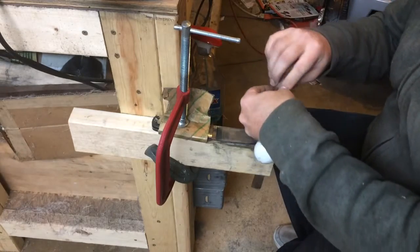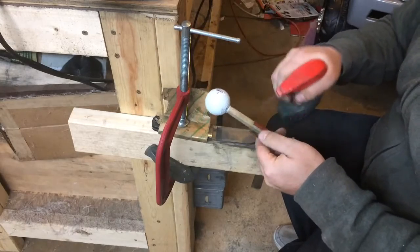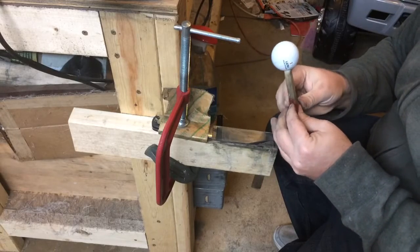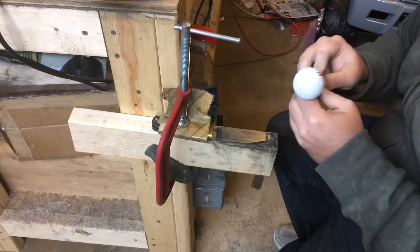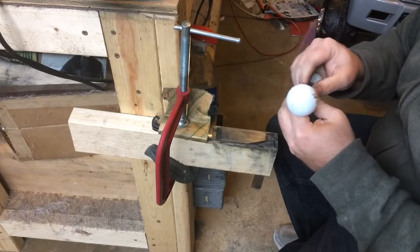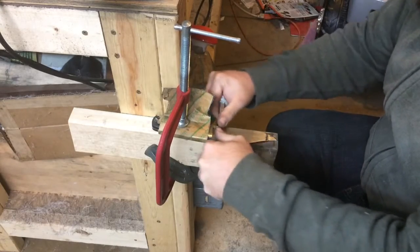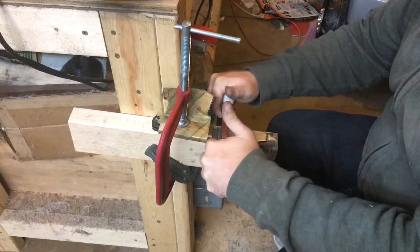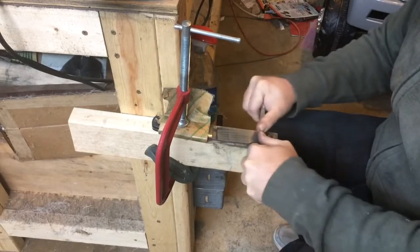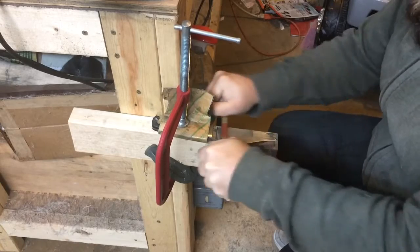One thing I found when folding it around this way, especially on the higher grits — if you kind of wet it down with your Windex or your cutting fluid, water, oil, whatever you're using, and crease it fairly tight — it actually almost kind of sticks to itself once you start applying pressure and breaking these corners a little bit. You can see I can get my thumbs over the paper to stabilize it a little bit if I need to, or I can keep my hands nice and far away from the edge.